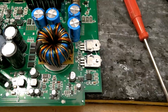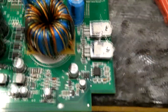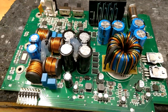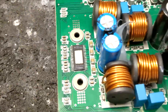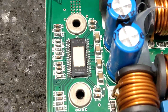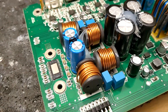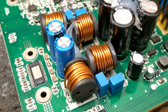Let's see what's going on inside. We've got the power supply MOSFETs, one push one pull, PWM generation, the transformer being rectified by surface mount rectifier diodes. Then we've got the rail capacitors and the actual amplifier - just this one chip. This is a TPA3255; all it needs is a power supply, audio input, a couple of external settings, and an LC filter network for the class D audio output before going to the speaker terminal, so we've got inductors and capacitors here.